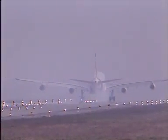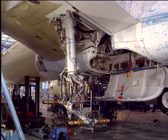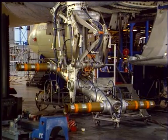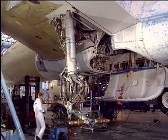Shock absorber removal and installation. Reminder: prior to this stage of operation, the aircraft must be jacked up to a sufficient level to permit free removal of the bogey beam. The shock absorber securities are installed and relevant safety precautions observed. The shock absorber is secured in position with a compressing tool. Let's start with bogey beam removal.